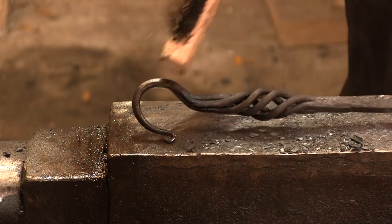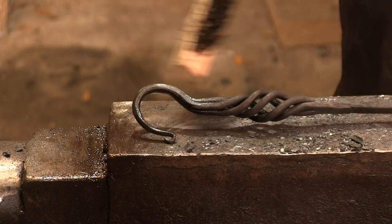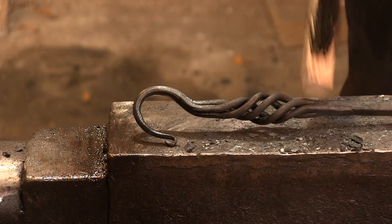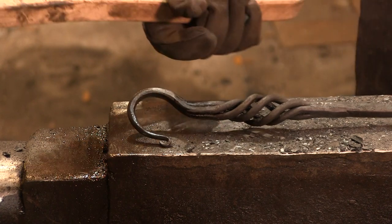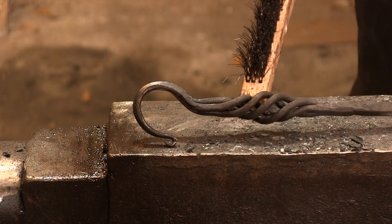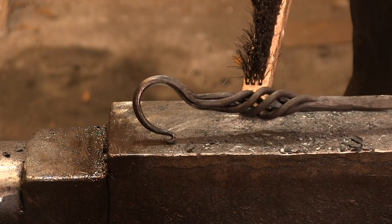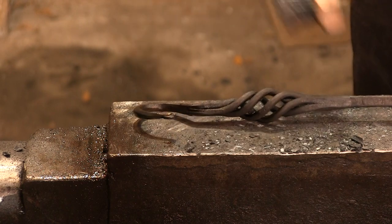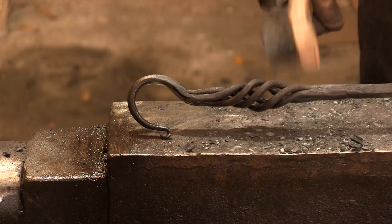All in all this is a pretty clean piece — we've got our nice evenly spaced spirals here, and these pieces come up and form very well into the hook. This area right here is normally a pain — I put that end in the vise and used the other end to twist with, and that's a trick you need to pay attention to. If you do it the opposite way, these guys have a tendency to come apart. But all in all, that is a good-looking basket handle — fits the hand nicely, good even hook with a little pigtail. Not a bad piece at all. Now we can get on to the front end, the business end of this poker, and make our turkey foot.